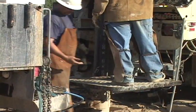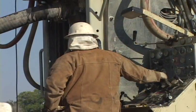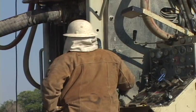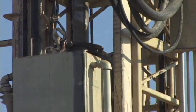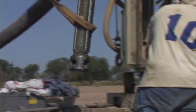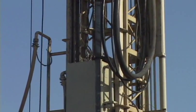Drilling and driving progresses simultaneously. Air operation allows finite control over the hammer to tap through boulders and pound through unconsolidated formations. In overburdened formations, the driller can use downhole air hammers or tricone bits to drill while driving the casing. With control over the drive energy, the driller can eliminate damage to the casing and drive shoe.